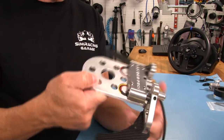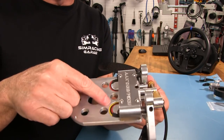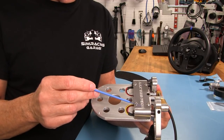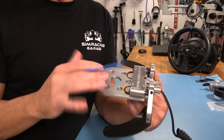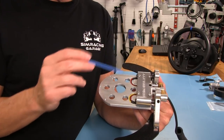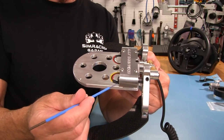On this plate, because of the electronics, we're mounting the steering wheel or hub up against it. He's milled out a channel — see how flat that is where these wires are? These wires come from sensors inside the case. These are not potentiometers; they are actually hall sensors. Hall sensors don't touch anything — there's no moving parts wearing against each other like a potentiometer would be. This is really a great feature, with a really long life cycle. He's milled channels into this plate to route these cables, so it's a good cable management channel.